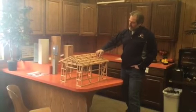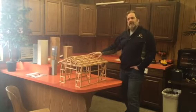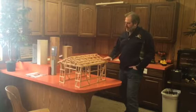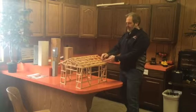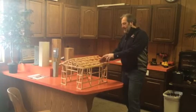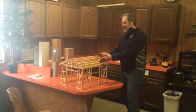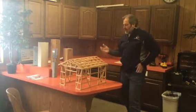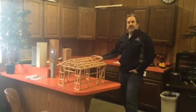That gives you very minimal deflection. When people do eight, nine, or ten foot on center with trusses, they put the two by four or two by six on edge, which only gives you an inch and a half to toenail into. So when you're putting your sheet metal on, you're only nailing into an inch and a half of board instead of three and a half inches. This is why I believe four foot on center with trusses is much better.